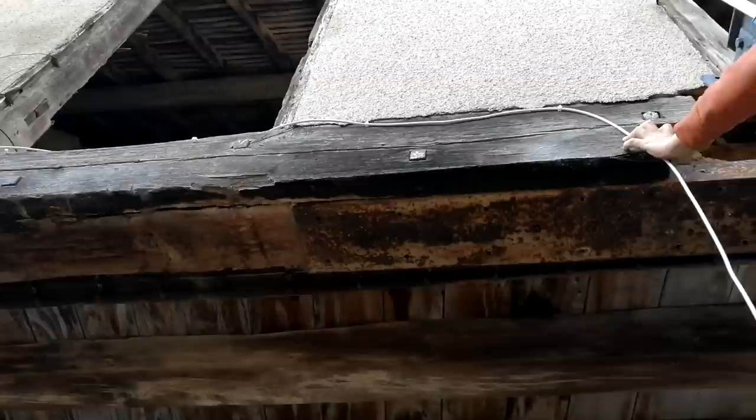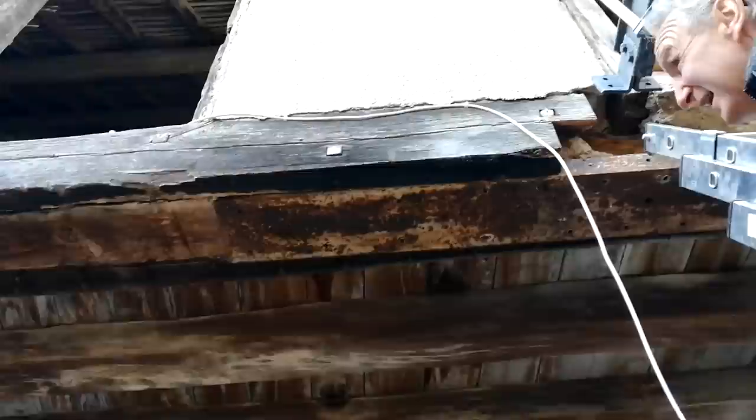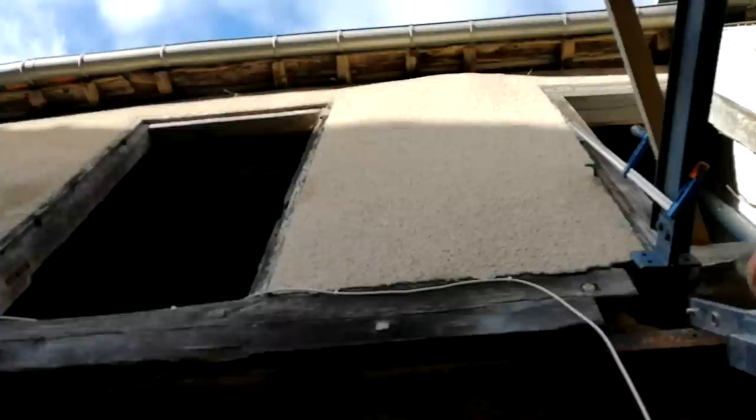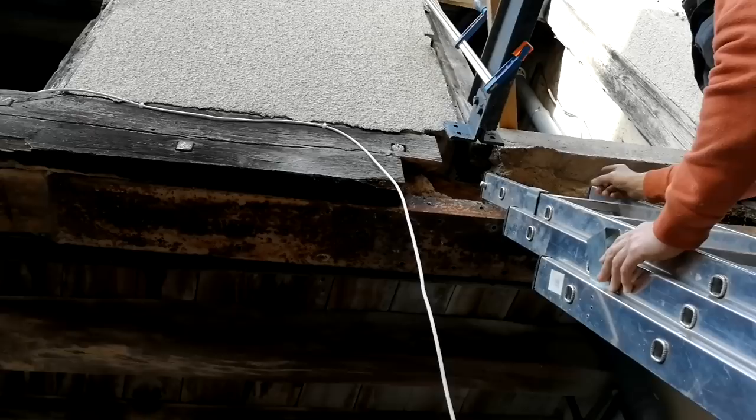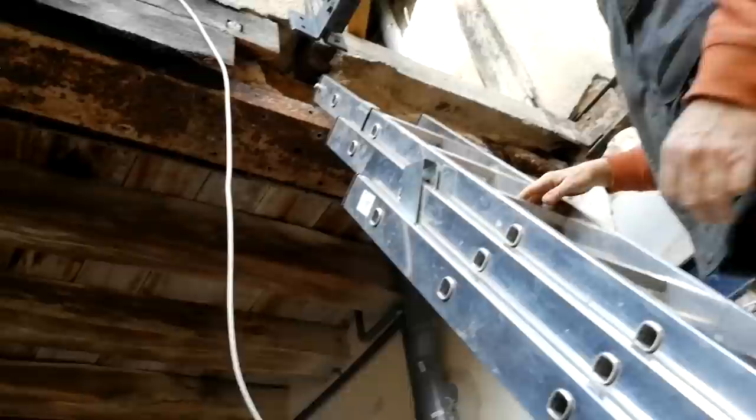Okay. So the original heavy beam is the same as these other ones going across? No, it's bigger than those. It's bigger, is it? Because it's holding up the wall. This is about a foot thick. About 300 by 300 mil. And obviously it's holding up these walls above us. That's a big oak beam, and it was rotted away here. So they stepped this under there, put it into the wall there. I can't see, Tanya, you're in the way. Put it into the wall there, bolted it through there to stop the beam from doing that. Now, this has been mended a long time ago, hasn't it?